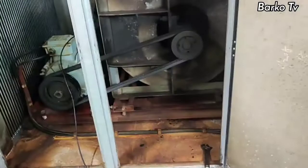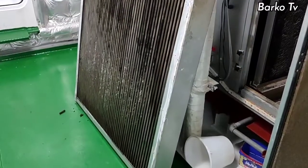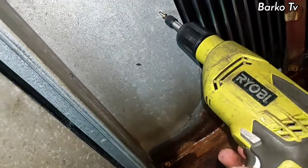Keep in mind to always wear goggles when drilling the screws. We use a self-drilling screw for easy securing of this water eliminator unit in its exact direction and right position. Also need to put sealant to secure it and ensure all air must pass through this unit.